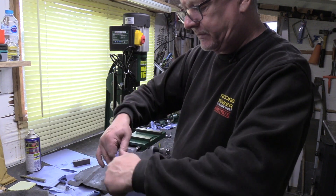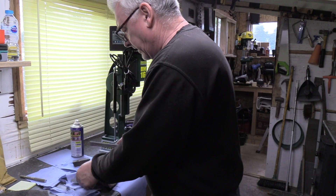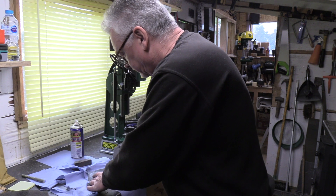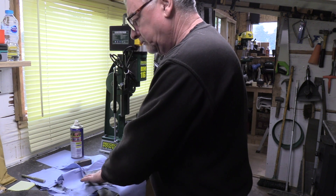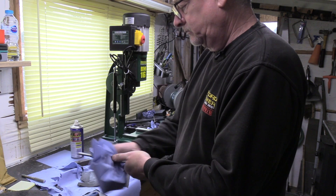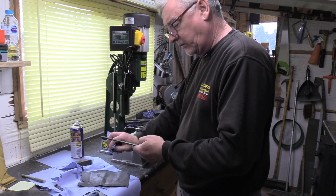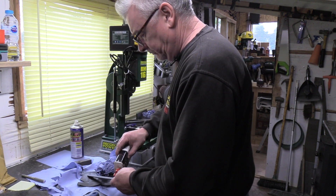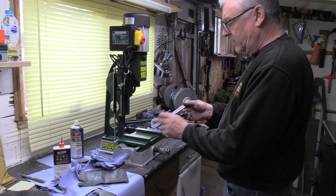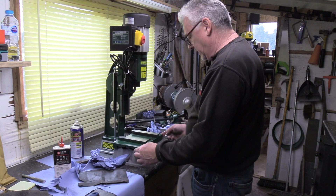You can see the working face which slides up and down - it's got the polished finish on there. What you can do with that is just give it a little clean and a wipe down so you're not going to transfer any muck back inside again. Just put a little bit of oil on there - it doesn't need much on the back face anyway, it's just your working face and the grub screw. Put your strips across, take it down, equal it up in your fingers.